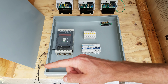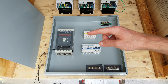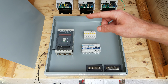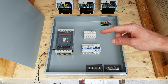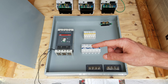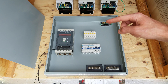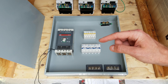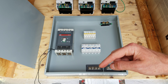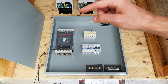The PV inputs will likely come in from the left and go up to the yellow PV disconnect breakers, which will then go up to each individual charge controller. The outputs from each charge controller will come back into the electrical panel and go down to the three circuit breakers which will isolate the battery from the charge controllers. After the circuit breaker it will go down to the positive and negative bus bars. The wire coming in will be four-aught cable, the wire from the charge controller to the breaker will be four gauge, and the PV input wire will be six gauge.